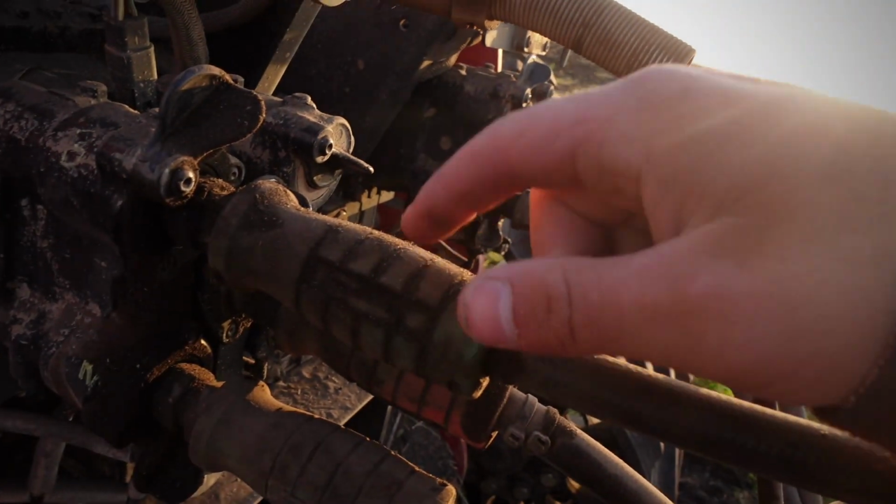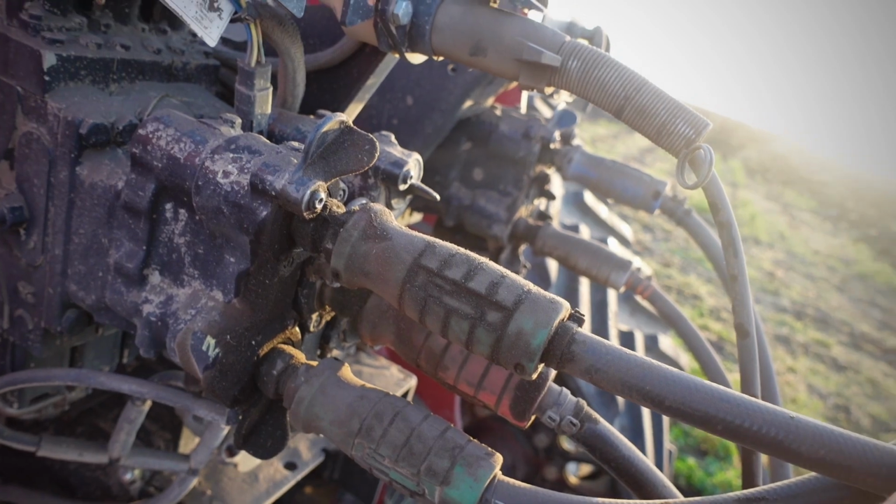And then another great thing about this plow, all the hydraulics are kind of, well, the second one's fine. The third one, I think there's some air in the line, so it takes about 5 seconds longer for the back 3 bottoms to go on the ground. And then the front one, I don't know what's wrong with it really. I'm guessing there's a valve shut somewhere, but every time you put the hydraulics in correctly, like I'll just show you guys. Every time you put it on the bottom, like it's supposed to be, it doesn't go. Like it'll just stop. That cylinder on that wheel right there, you can see it doesn't go down farther than 1 inch. It just kind of doesn't work.